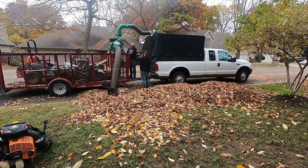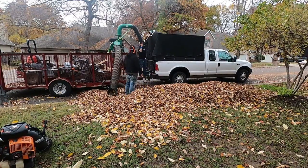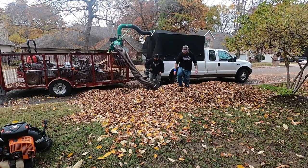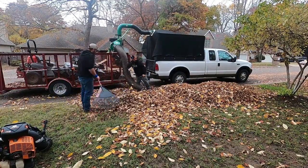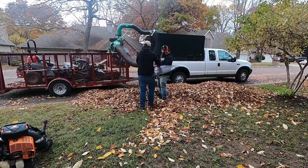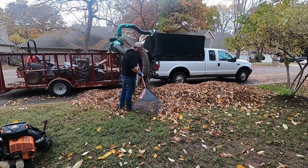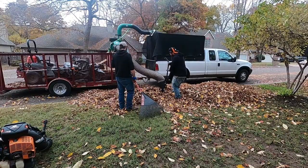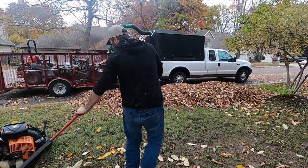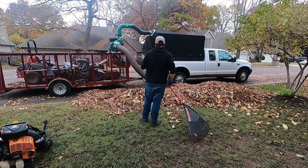Right here, we're having some issues — it's getting clogged up and slugged up, and we're trying to figure out why. I'm doing a little troubleshooting: is the hose not hooked up right? Is something going on? Was something not cleared through the line? James was using it, and at this point I'm just kind of checking it. It clogged up on me too. It ended up being that there was a stick caught in the hose sideways and we couldn't see it. We got it out and it started working better. It took us a few times getting it slugged up to realize that thin little stick was caught sideways — I was just seeing if it was user error, and sure enough it got both of us.